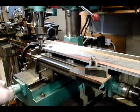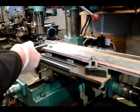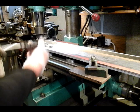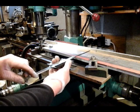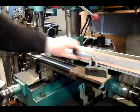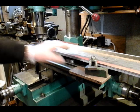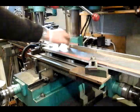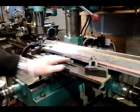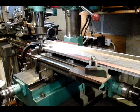Using my vernier gauge just to double-check everything's coming out square — I'm within a thou and a half, which was my roughing cut. I'm going to take a finishing cut on that part, then that part's finished. I've left 40 thou on to machine the other side. I've clamped both plates together onto parallels, giving me enough space to machine them.